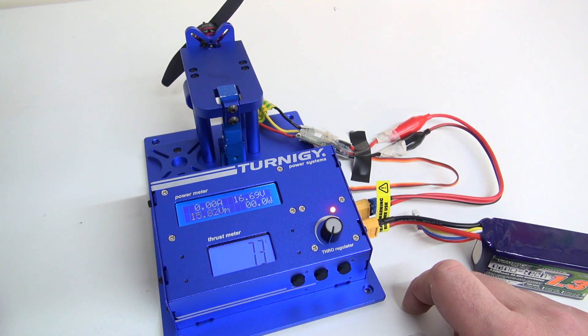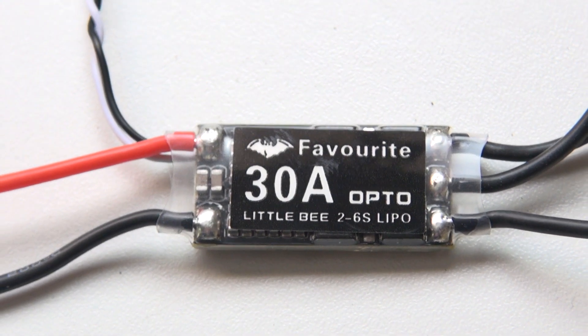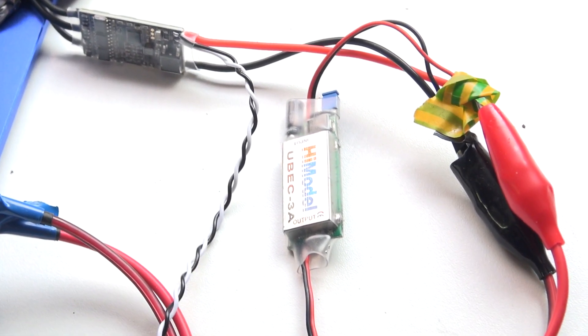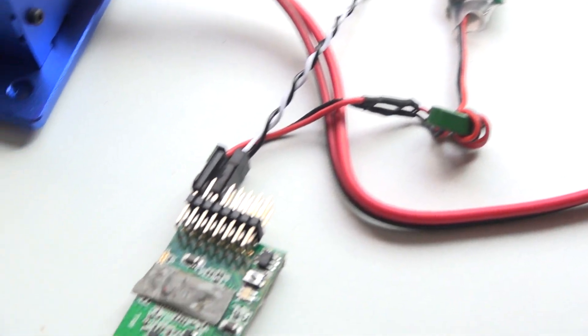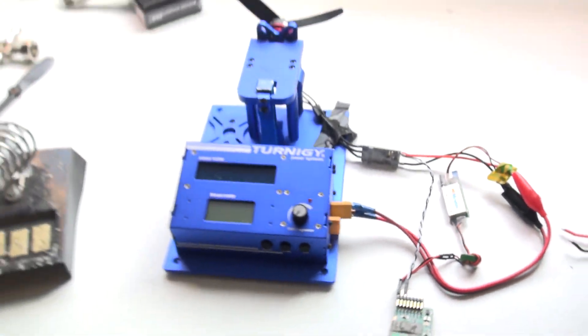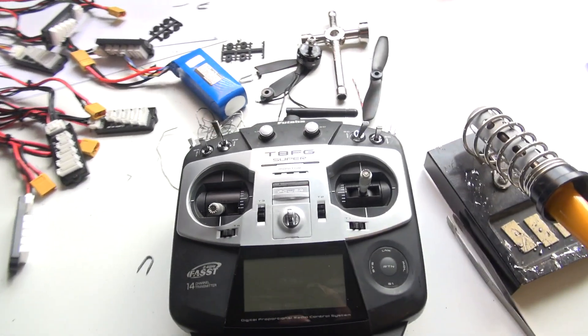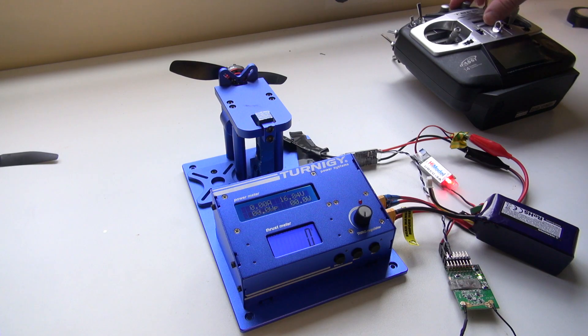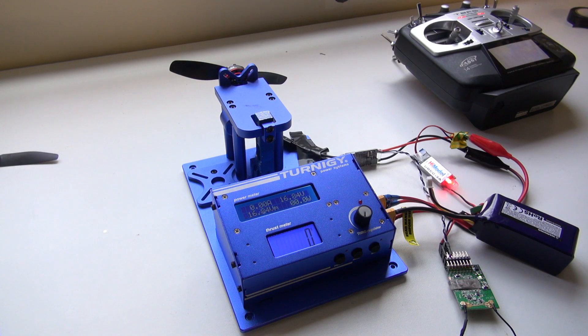This was the case again, so I decided to up it to 30 amps with the little B ESCs. These are Flash 2 BLHeli 14.3, while the 20 amp AFROs I had before were Flash 2 14.2. Switching to new ESCs brought new problems — the main issue was that the analog servo throttle controller on the thrust stand could not communicate with the ESCs fast enough. One workaround was to use my transmitter and receiver to give the ESC its commands, though you could also use a flight controller, it's a little more clumsy.